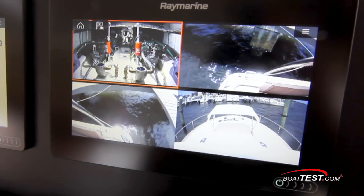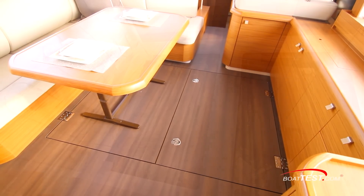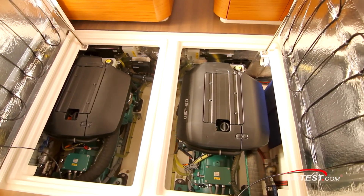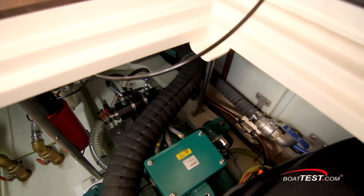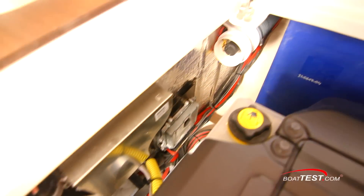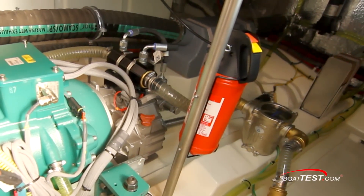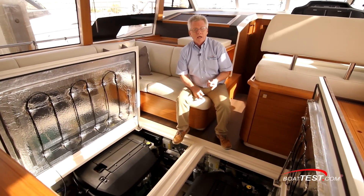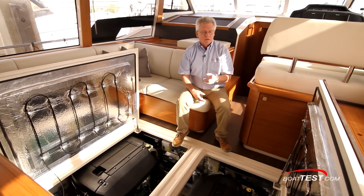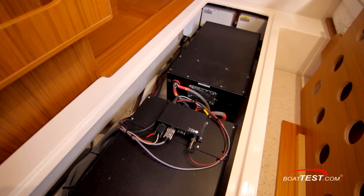Let's take a look at some of the operational features, starting with the most significant. The engine room is accessed from two hatches in the main salon. The focal point is the twin Volvo Penta D3 220-horsepower diesel engines. The fuel tanks are in the back and the water tanks just in front to both sides — they have crossovers going from one to the other, so you can fill one and the other will level out automatically. The fire suppression system is visible just behind, one to each side. The main point of this is the hybrid installation. Like all the boats in the Greenline lineup, they're available with hybrid options, and it's a very simple system — nothing more than an E-unit and batteries.